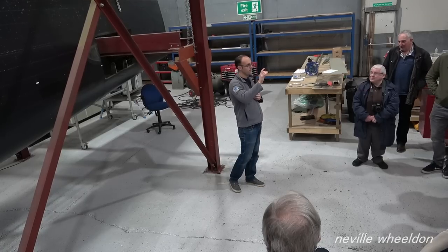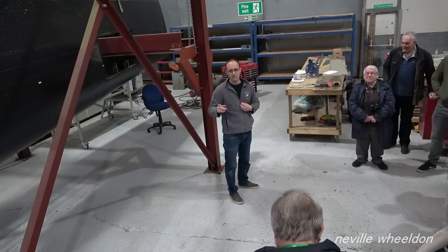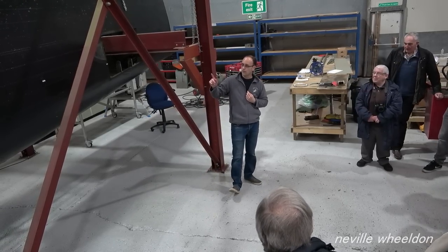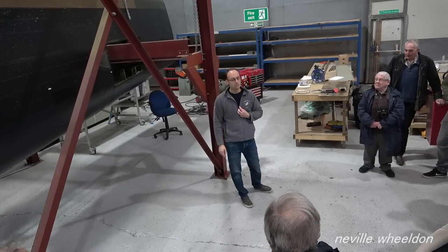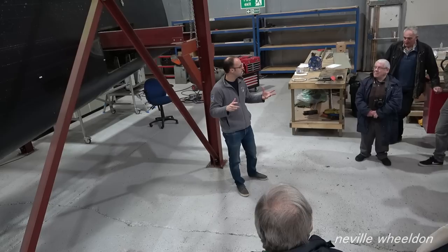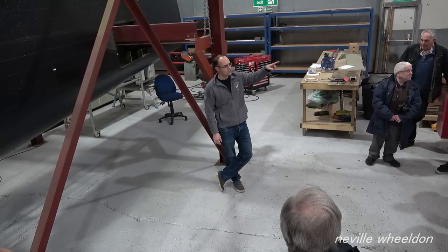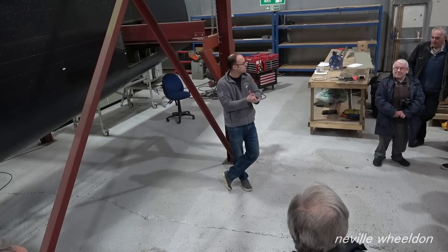NX664, the French one W21, was built on the same jig as NX611, so in theory the parts should just fit. We didn't know whether the Canadian-built KB976 rear fuselage would straight-fit onto the British-built NX611 — but it did. So although there are some slight differences that we know about, the major sections appear to have been built to the same jig. We also know this wing of W21 has a Canadian-built trailing edge and aileron, suggesting a Canadian-built item fits on a British-built item without any problem.